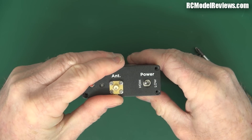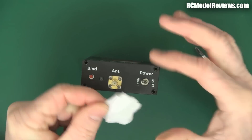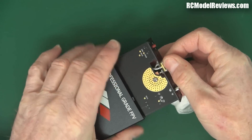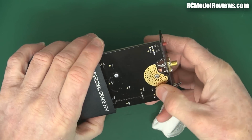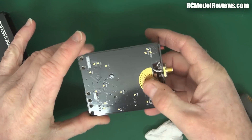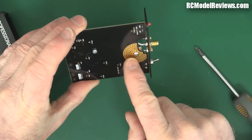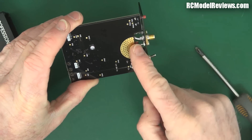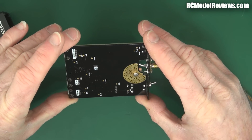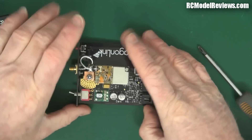It slides out — and there was a piece of foam in there on the side of the board; I'm not sure if that was supposed to be in there. Let's have a look at what we've got. Black solder mask — I don't like that, but I won't go over it. This is interesting: a whole lot of vias in here — little holes which are plated through to help conduct heat from one side of the circuit board to the other, so I expect to find something that gets hot on the other side.